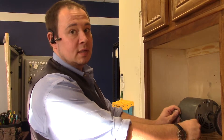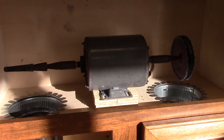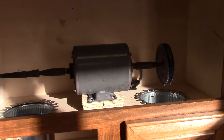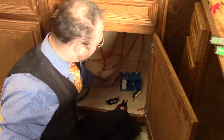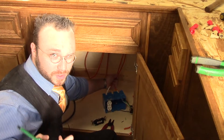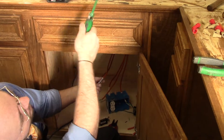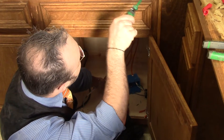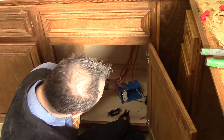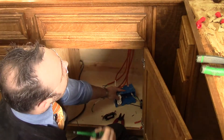I've created a base and I'm bolting in the polisher now so we can record it. We have our polisher bolted down and our suction chamber vented outside. So I did my math precisely correctly — I've got leads grouped through two groups of three. One and two correspond to banks one and two in the first box; banks three and four correspond to banks three and four in the bottom box. Starting at the top, moving down and over, you'll be able to tell which outlet corresponds to which switch without having to test them.